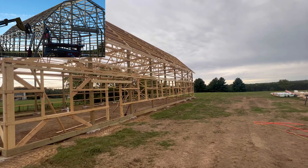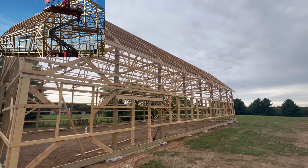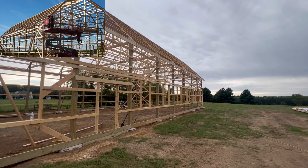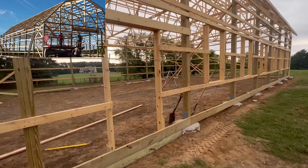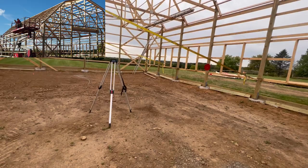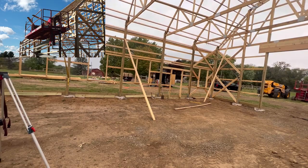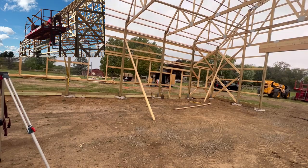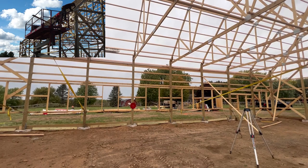Our framing is basically done at this point. We've got all of our fascia nailed on, all our windows in, and our ladder frames done. We'll straighten one last time, make sure the soffit and fascia look good and straight. Here's where the man door is going to be. You can see the windows are all in — we still need to put some blocking to nail the windows in, but we'll do that shortly.